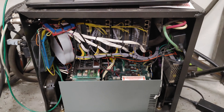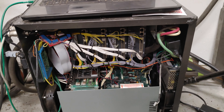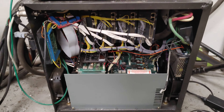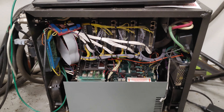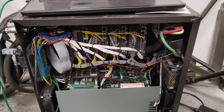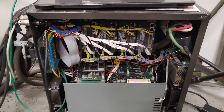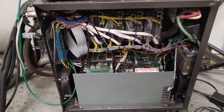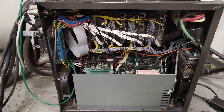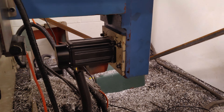So that's the control — this used to be on DC drives. It just never worked properly. They were really hard to get tuned and the drives I got just never worked reliably. Like, all of a sudden it'd lock up a servo and then delete the parameters on the drive, and then I'd spend a few hours resetting it, tuning it again, and then it worked for a few months and then did the same thing. So I just got fed up and changed everything to AC servo drives.